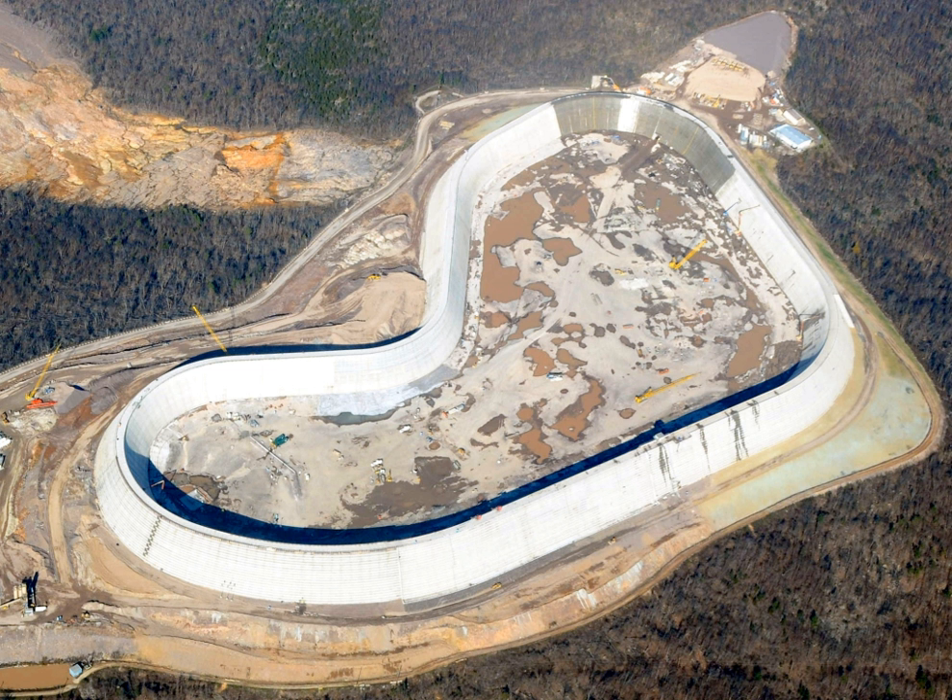The Willow Creek Dam was constructed by the Army Corps of Engineers between November 1981 and February 1983. Construction proceeded well, within a fast schedule and under budget — estimated $50 million, actual $35 million. On initial filling, however, it was found that leakage between the compacted layers within the dam body was unusually high. This condition was treated by traditional remedial grouting at a further cost of $2 million, which initially reduced the leakage by nearly 75%. Concern over the dam's long-term safety continued, although only indirectly related to its RCC construction.